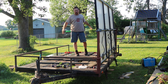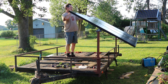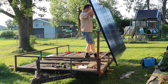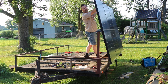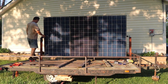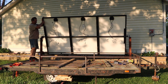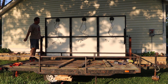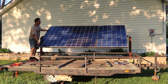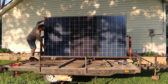So here it is — vertical, ready for trailering and towing off somewhere. And then once parked, ready to absorb the sun facing south, this would lock into position at about a 45-degree angle. But it could go all the way out — in winter with a low sun it could be steep like that, and in summer probably something more like this. This isn't like a solar tracker or anything — it's just so the solar panels fold up for transport and then fold out for actual use, soaking up the sun. I'll probably do both a summer angle and a winter angle on that lock I designed. And this is only half of it — there will be three more panels on the other side of the trailer, and they're designed so they're spaced out so they will not hit each other when they fold in and out.